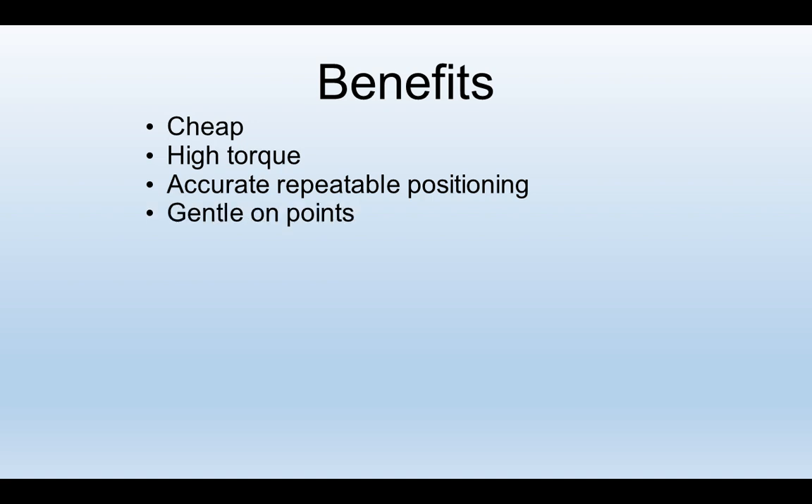From model railway point operations, they're a safer bet than solenoids. Solenoids have the downside of the constant bang of capacitor discharge units, eventually damaging points, whereas servos can be moved very slowly, gently, and more prototypically. That's because we're able to set the speed of a servo.